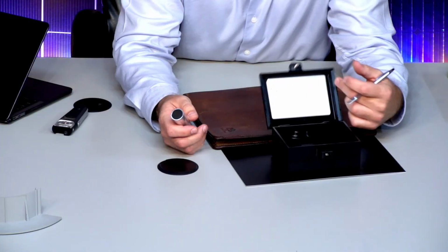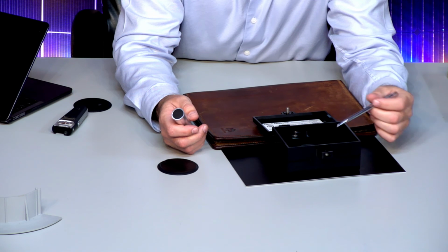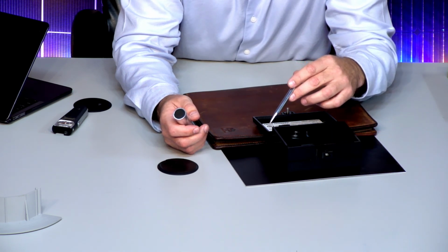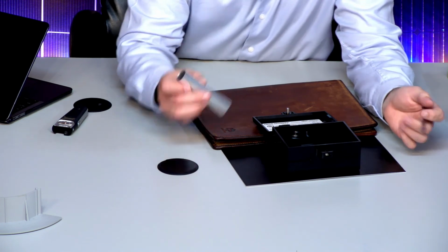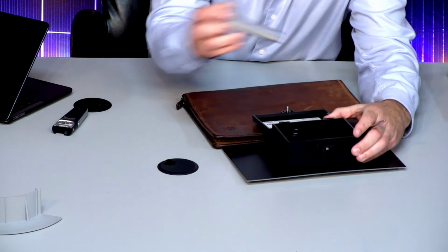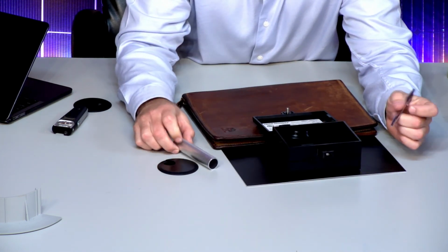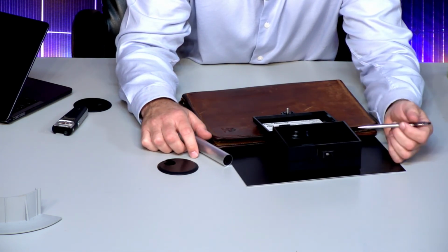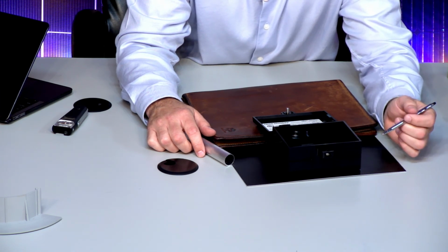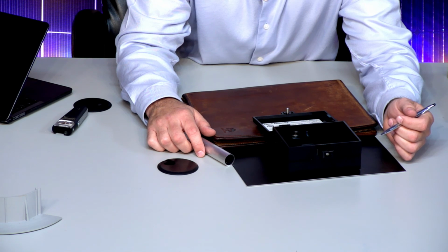And then inside of this box, they've really designed this pretty well. There are a couple of gasketed fasteners here. Again, you put the sealant around the back, and on this one they come with a little bit of a riser that would fit down in if there was a hole there, so we'd be able to put that down into the attic, and then your wiring goes right in here. Then they make the connections and wiring, and they can drill into the bottom, so it'd be downhill from the rain actually.